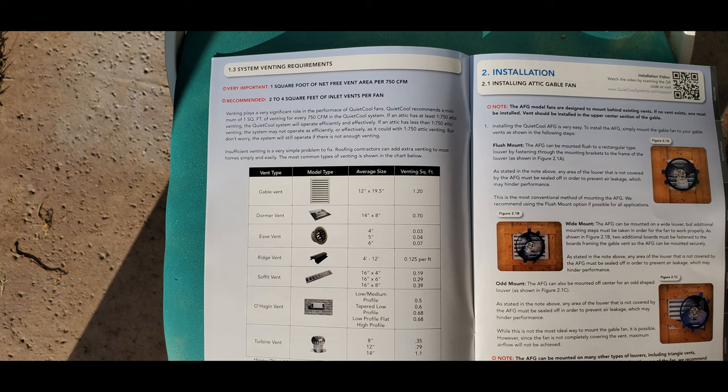And this page was actually the same exact page that was on my whole house fan. When the installers came to install my whole house fan, they did not measure how much ventilation I currently have, that my attic is capable of exhausting, given that we are positively pressurizing the attic to make sure that it would be able to run efficiently. They did not take the measurement. So when I tried to use my whole house fan, I wasn't able to use it to maximum effectiveness.